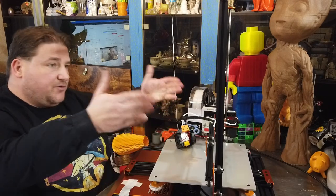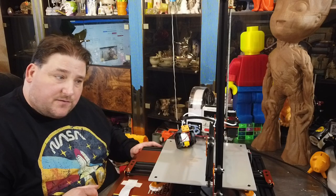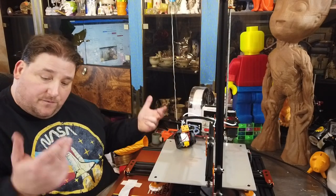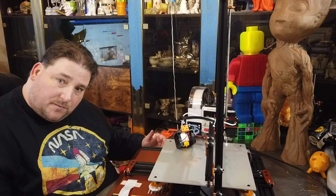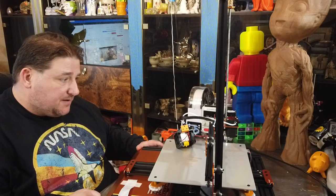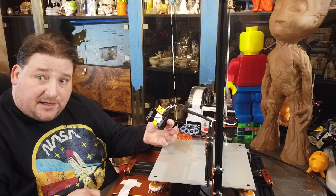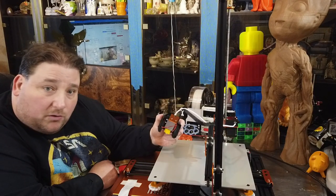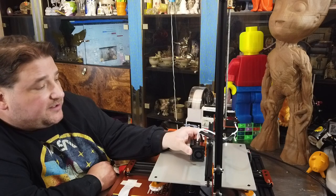Okay, next you drop the gantry into place, your vertical gantry. Make sure this is high enough not to be in the way. And you put the four bolts in from the bottom to attach it. The next step will be to attach this really spiffy little modular hot end. This little hot end, two bolts, and it just bolts right on just like that.